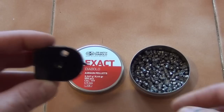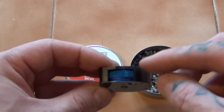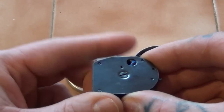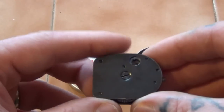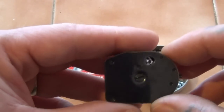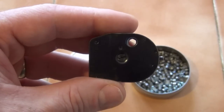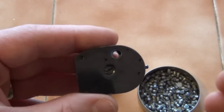I'm just going to show you a little bit of the custom work what Phil's done on my magazine. There's a Twister magazine — a normal 177 calibre BSA magazine with a rubber O-ring — but if I hold it up to the light and spin it round, you can see each one of the holes now have got an edge on, and that's all 10 holes. The reason Phil's done that is because a pellet's got a skirt, and the edge will help it to actually seat better in the magazine. So if it's seated better, when you cock the rifle and push the probe forward to put a pellet in the breech, hopefully it will seat that pellet a lot better — the same each time — which will give you good accuracy.